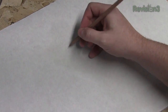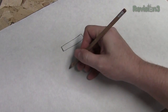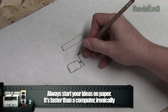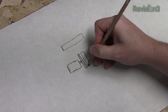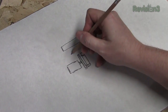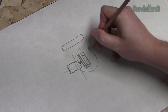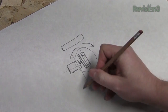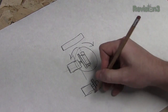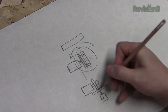We need to think about how to make the laser mount. The laser pointer is a little tube that needs to go in two directions: up and down, and left and right. First we'll make the up-and-down motion — the motor shaft goes into a disc, and the laser mounts to that disc. Below that we need horizontal movement. We don't want to center it on the motor or it'll be lopsided, so we put the center point on the structure itself. There'll be a disc that causes it to turn left and right, driven by the other stepper motor. So this is our X-axis and this is our Y-axis.